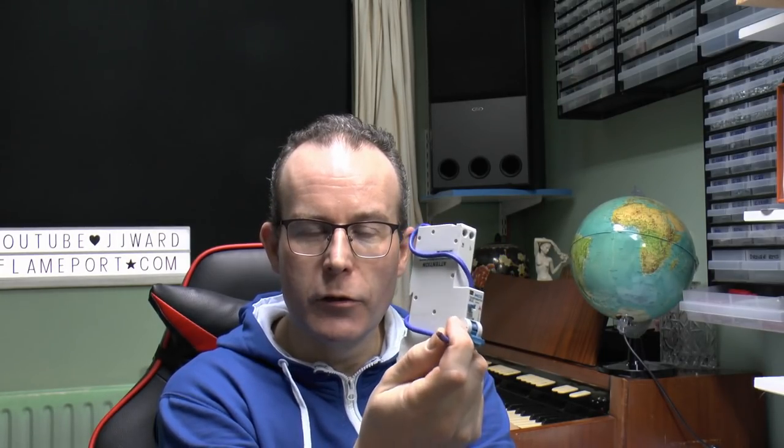So that's yet another variation on the theme — this MCG one is a single module but tall size, switching in the line only with neutral solidly connected. Very similar to others in many ways, but also different. We are going to test this on the arc rig we've seen in a previous video, and also alongside others on different types of fault including actual damaged cables. That's coming up later, but until then thanks for watching.